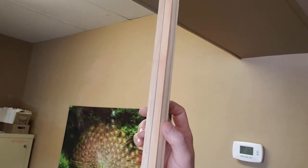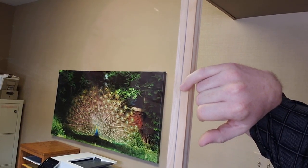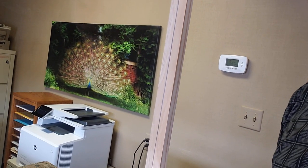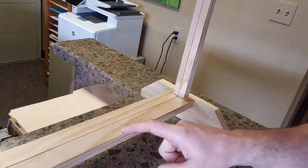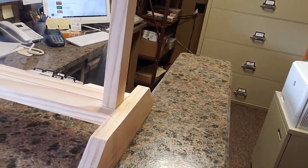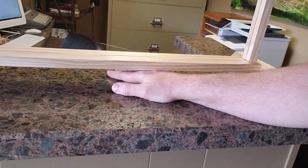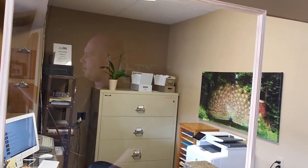First thing I did here was these little guys — these are just 1x3s ripped in half, and then on all these pieces for the frame you go through and just rip a single blade width right down the middle. Most 10-12 inch saw blades will rip an eighth of an inch right through there. The bottom piece is a full 1x3 ripped, and then the tops and sides are all half 1x3s. Then to put it together down on the bottom here I just have a 1x3 on end and then cut the corners. I had it up high enough so I can slip papers, credit cards, clipboards through there, and that gives a pretty good little shield.